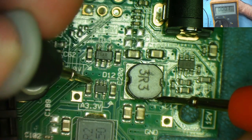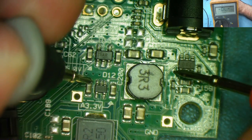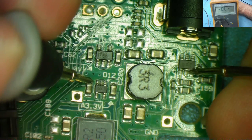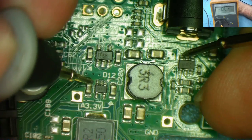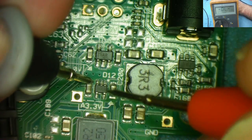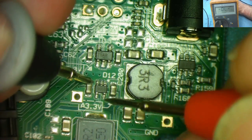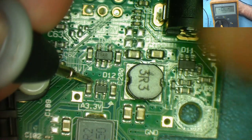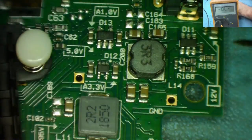Yeah, we've got continuity. So this is probably a 5 volt supply, I'm just guessing. And then this chip, probably somewhere, connects to it. Well, it certainly connects to there. Because it's a short on the 12, it might be difficult to say, because you'll probably find it connects to quite a few places because the short is distorting what you're reading. So I can't say for certain what's driving that. It might well be this one.